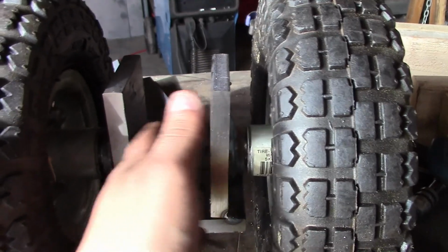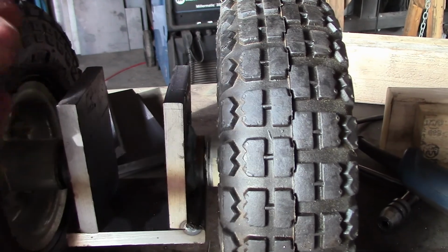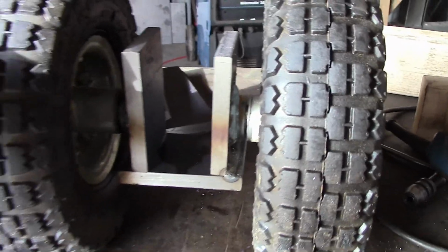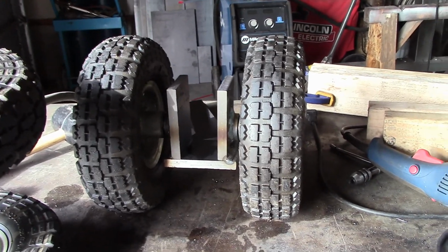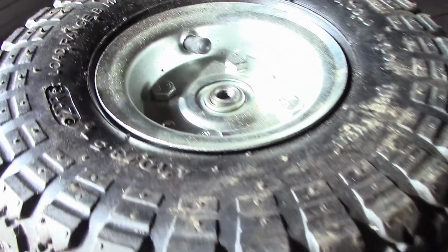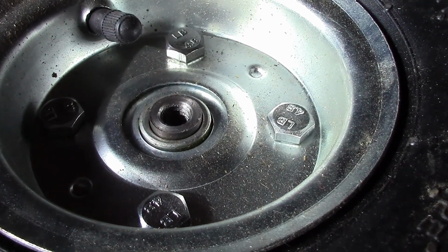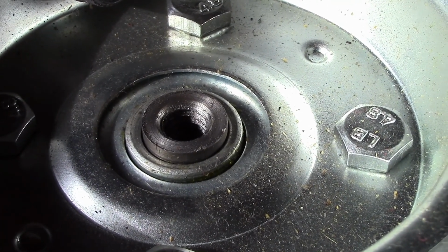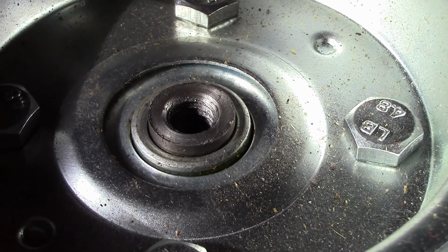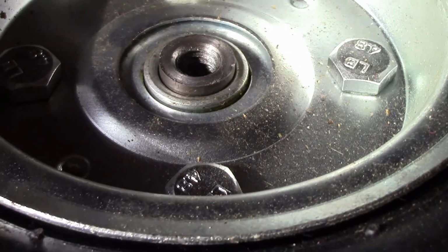Put your material in here. I mean, I've made it 2 inches wide, but if needed, you know, you can always shim it to tighten up the material in there. And those wheels just sit on that. And looking at this one, you'll see that, I mean, just barely a little bit proud of it so that you can just put a washer and a bolt down on that and retain the wheels that way.